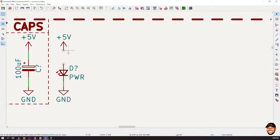I recently watched it. The whole thing is, LED is about powering up, and LED is about brightness. If that gives them the brightness they need, then why not? You get a point here. Using an LED is about the brightness you need. I could decide to make 20 milliamps flow through it. It is just the brightness. So if for my application, I just need it to be very dim, then whatever resistor value suits it, you can just use it. Personally, when I'm doing this, I throw in 1K and do that. But I just wanted people to know how to find out the values for this.